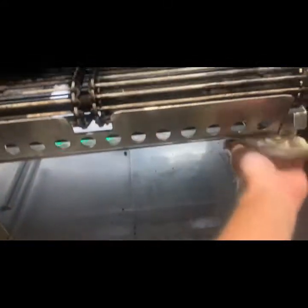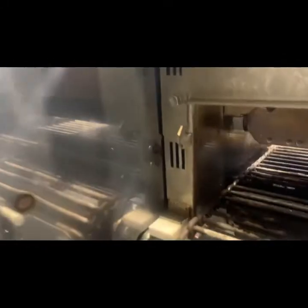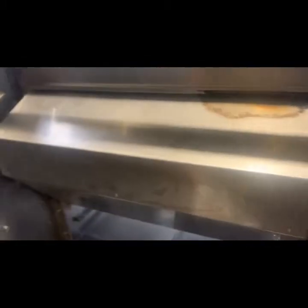This is in part a heat shield - it'll rest below the chain, and you can see there's not such a gap that a burger should be able to get stuck in there. Then there's the actual scoop. This is the scoop - there's a hook and a hook, and there are two pins. The scoop goes in with its top lip into the unit and that lets the hook catch and drop. This needs to swing freely because burgers will get stuck in there and you can tap it from the front and it drops loose.